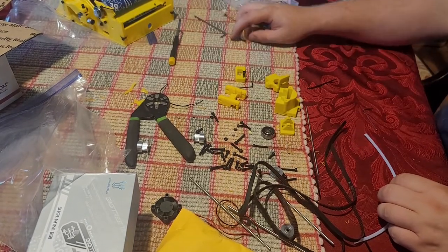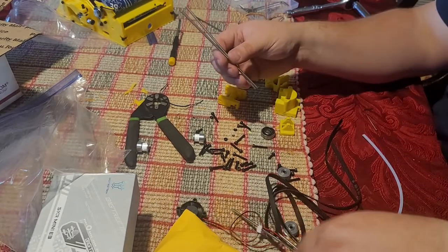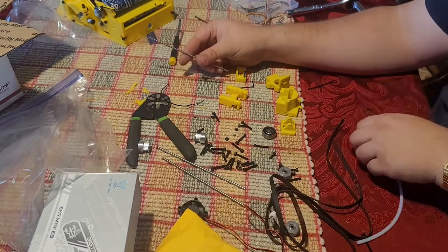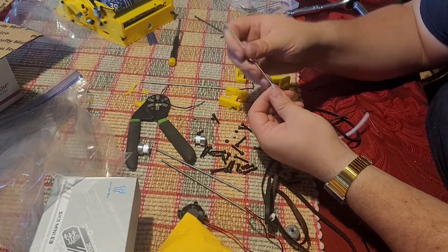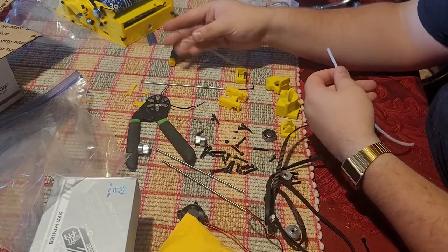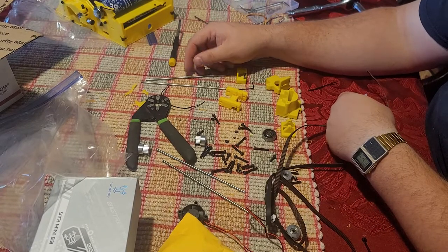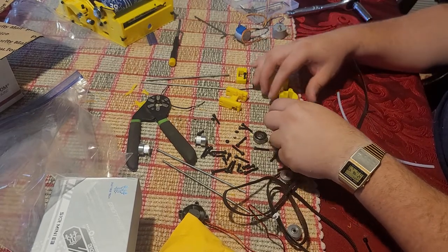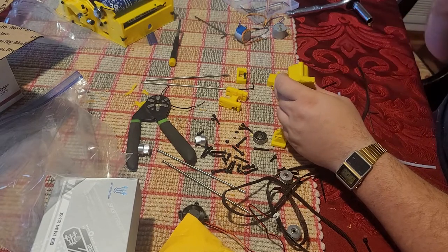All right, so the way this works is your 3 millimeter, 150 millimeter long rods are your linear bearings. And then we're using 3 mil ID, 4 mil OD PTFE as the bearing surfaces. So the first thing we're going to do is assemble the Y section, because once we assemble the X motor on, it's harder to tension the X belt.